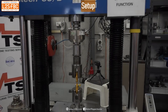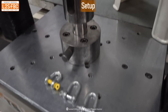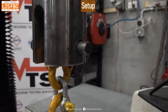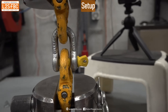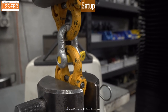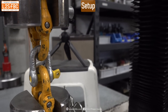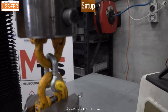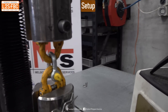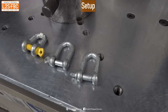Here's the test setup. There's the machine that's going to pull the shackle apart, three shackles waiting to be tested, and right there is where the shackle is going to be pulled. We're going to go to one tonne at the rate of a thousand kilograms a minute, so it'll take one minute to get to that tonne load, then we're going to back it off, do it again, and see how well it manages to undo.